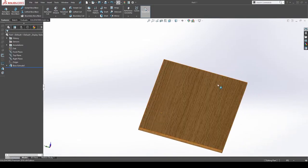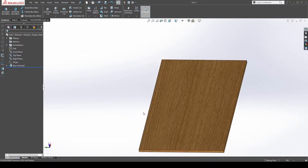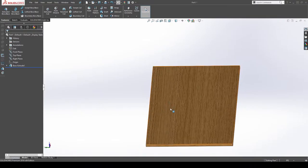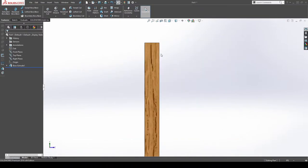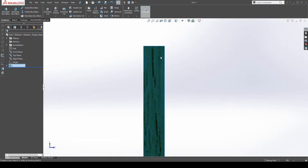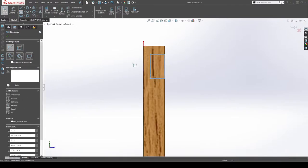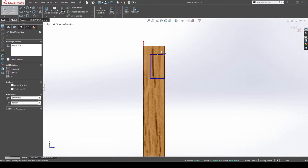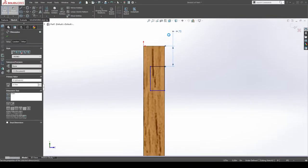So, the only thing we have to do to this piece of plywood is run a dado. Do you know what that job consists of? So we're going to run our dado. And again, we're going to offset it from this backside 3/4 of an inch for our nailer strip.